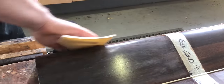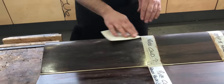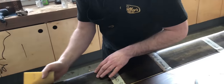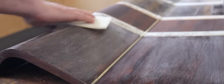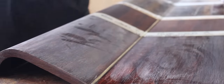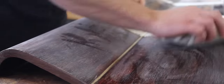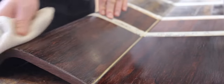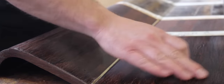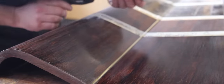So the process of French polishing, well, I'm just doing this. Once you're happy with the surface, the bare wood surface, the raw white wood, as you call it, substrate, it is stained, grain filled, fadded, which is where we're at now. We're cutting back those fads of polish, ready for colouring, which would be the next stage of polishing, where we would either apply colour with a colour fad, the same sort of fad that I had before with colour added to it, over the surface, which happened here, or I'd use a pencil brush and touch in any areas that needed colour added to them. We're not going to do any of that because we want this perfectly natural finish.